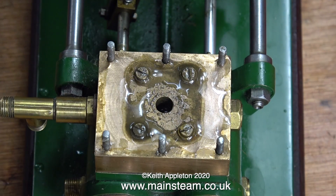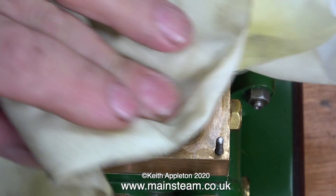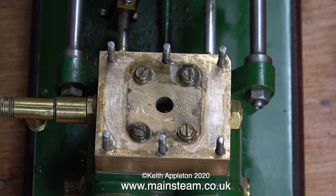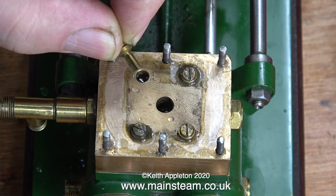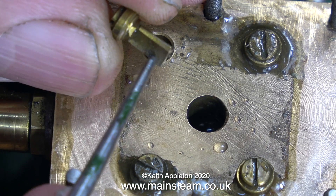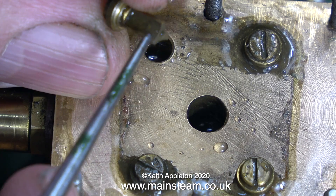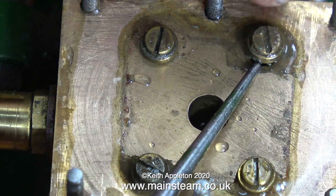Just be careful of your fingers — it's no good bleeding all over the pump. Inside the top chamber of the water chest are four valves: small poppet-type, mushroom valves, very similar to car engine valves. I can see the bottom right one is moving okay and the top left one's fine, but here's a close-up of the problem. I flushed this engine about five or six times when I rebuilt it and put it back together on the steam plant to try and get rid of the silicone rubber.